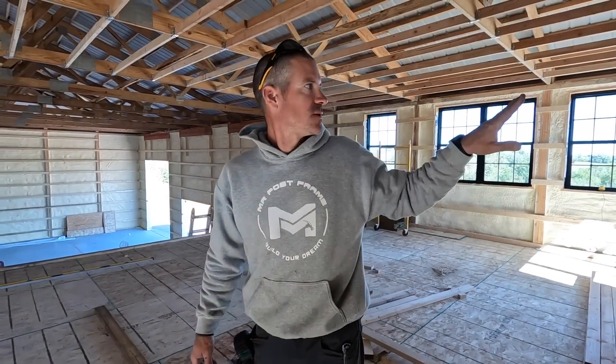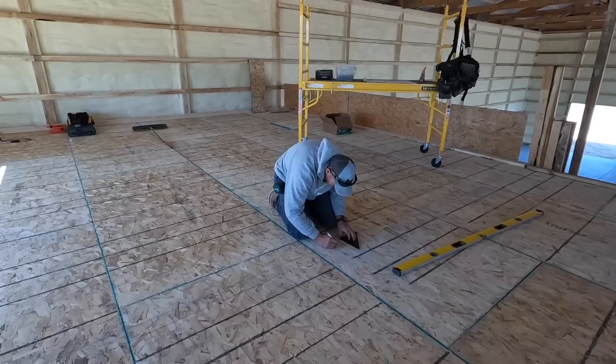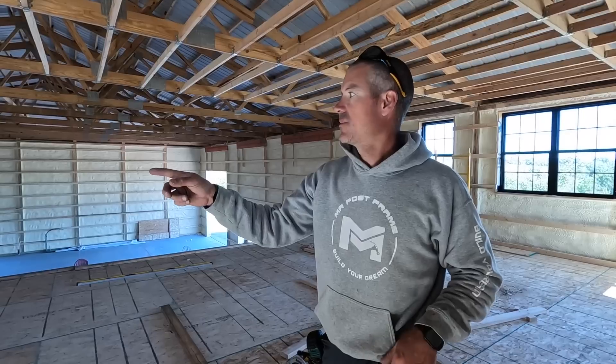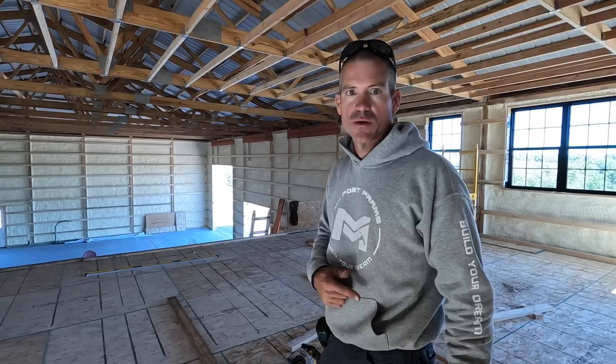Jake and Cash got all the interior directives up here on the second story. I have all the walls marked out on the floor — where door openings are and all that — so even if I'm not here, they can easily see what's what, because we did change the plans quite a bit. They're going to start framing up the outside wall to give us a barrier from the drop off. I'm going to start laying out all the bottom plates, and in the next couple days we should get a lot of this framed up.